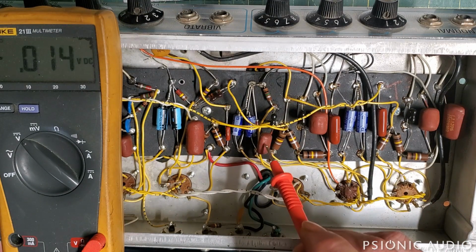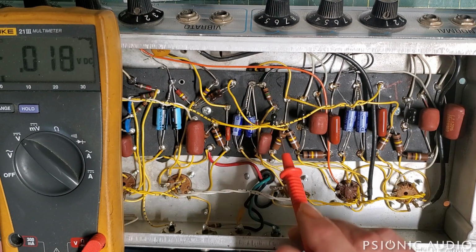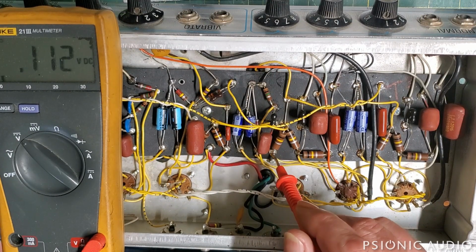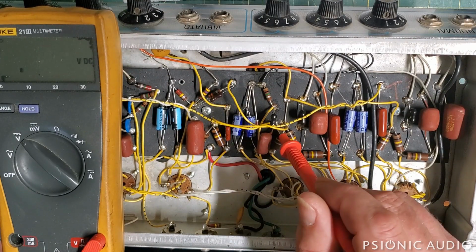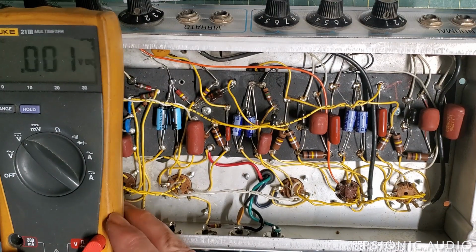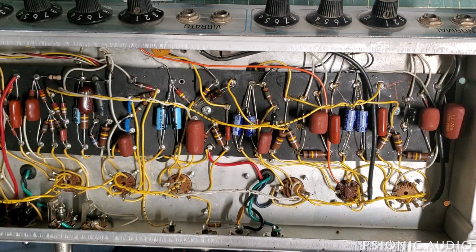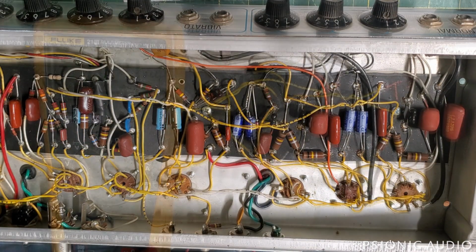The reason that putting an orange drop in here gives the illusion that this was a bad cap is because people resolder when they put the orange drop in, and that heats up that area and drives the DC out a little bit. I'm going to do it hopefully semi-permanently. I mean, it will need to be redone in 10-15 years, but it should last a long time.